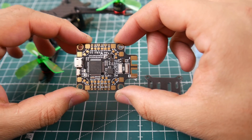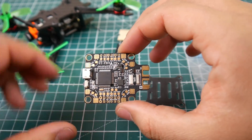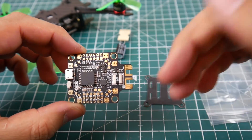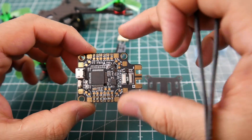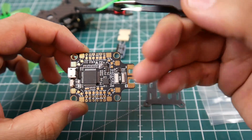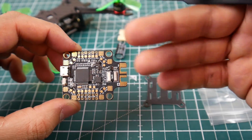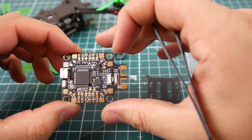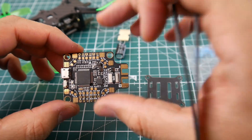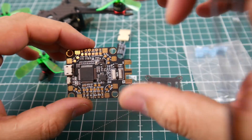The extra telemetry pads are a huge plus. They're using the big brother F405, not the little one — there are two versions of the F4 microcontroller unit. The bigger one has more pins, more inputs, and is a little bit faster. The smaller ones are capped at around 100 MHz, if I remember correctly.